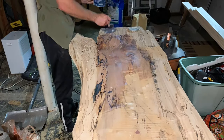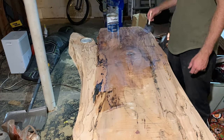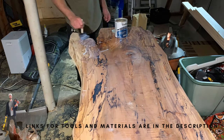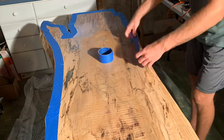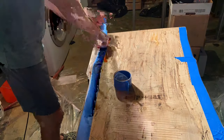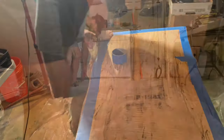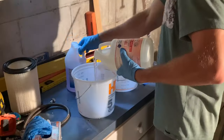For the bottom side of the slab, I used water-based polyurethane and applied three coats with a foam brush. Because I'm going to apply an epoxy finish on the top of the desk, I put some painter's tape on the bottom just in case any epoxy drips form — I can easily peel them off before it hardens. And as always, before you start using epoxy, I highly recommend that you put some plastic down.